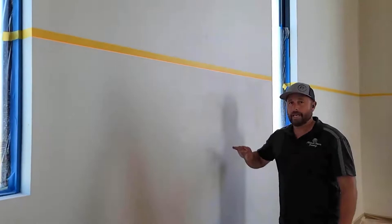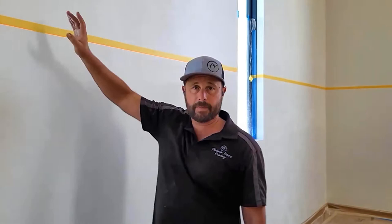Since we're doing onyx black, obviously we're not gonna try to cover this thing in one coat. So in about 5-10 minutes, Jose is gonna drape some plastic up from this line. We're gonna do a really quick tack coat, kind of an ugly coat. And by the time I get done doing that, in that corner, it's warm enough in here to be dry. And then we're gonna come right back behind it to do the really nice, pretty coat. And then we're gonna pull our yellow line while it's wet.